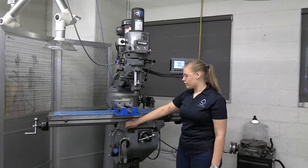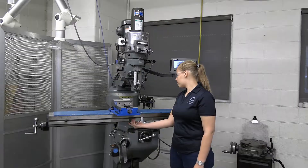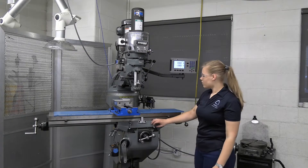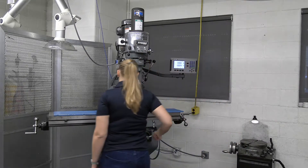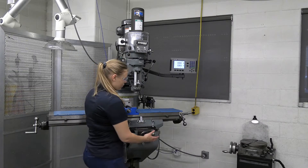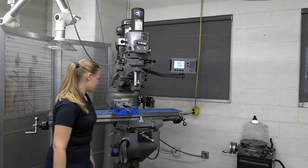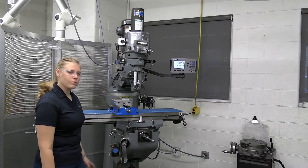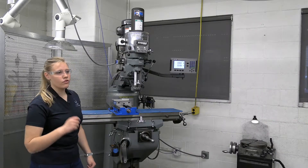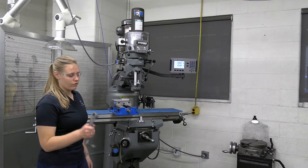We often like to use the table locks. There are two for each axis — x, y, and z — but we don't use the z locks because the z is so heavy. You want to tighten them slowly so that you don't move the numbers while you're working. Same idea goes for the z. You can tell which way the handles turn by using the right-hand rule: if I want to turn towards me I go up, if I want to turn away from me I go down. If the right-hand rule is too complicated, just move your part away from your tool and practice — you'll get the hang of it. We keep the z handle on backwards so that we don't hit ourselves in the knee.